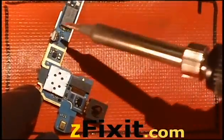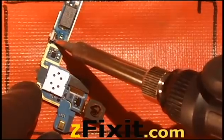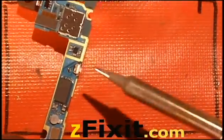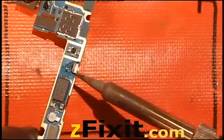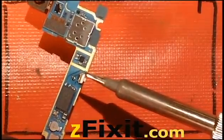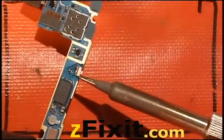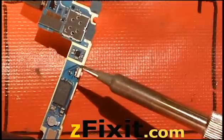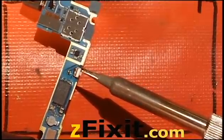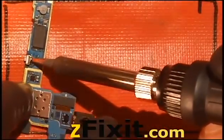The soldering iron is set at 340 degrees Celsius. It could be lower, but I found that it just takes longer if it's lower. The first point I touch is the rear anchor point, and then the two solder points from the left and the right. The ones that are really difficult are the ones to the left and right of the buttons, as there is a significant solder pad with large surface area that the new low melt solder needs to flow into. You can just leave the soldering iron and let it flow — it will flow eventually. We're just trying to get the new low melt solder into the solder pads so that it lifts or comes off much easier.